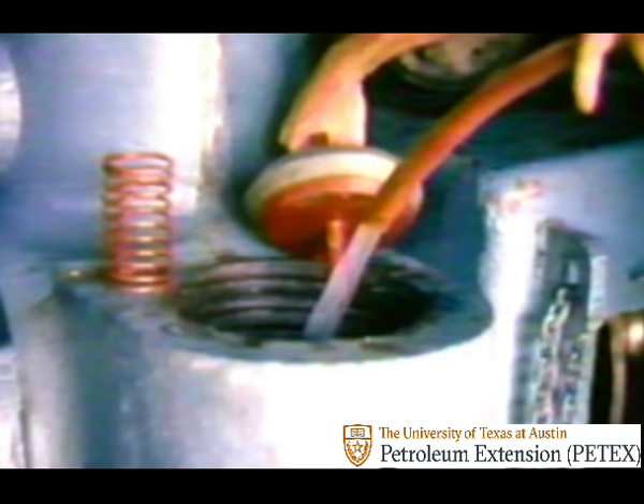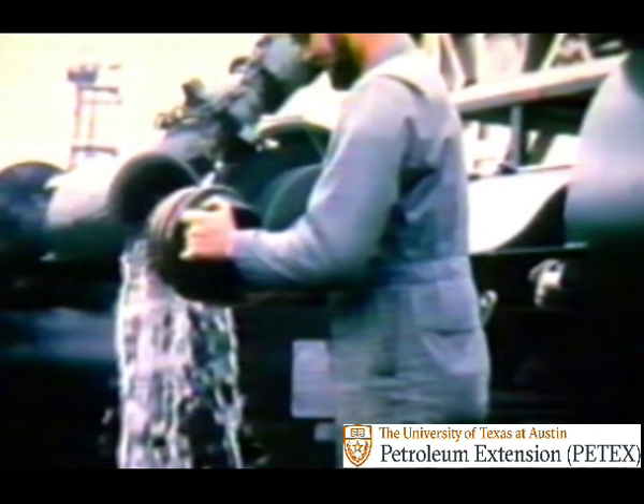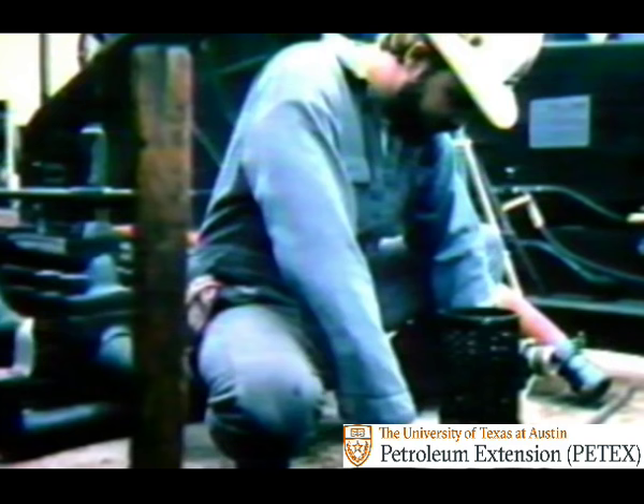So if your pump doesn't have a flooded suction, prime it by hand—preferably with mud. The shut-off valve between the tank and the pump must be closed, and the pump should be primed through all its valve pots before turning it on. If you do prime the pump with water to check it out, you should also do other maintenance at the same time, like taking a look at your discharge strainer. Unscrew the head, let it drain, and clean out bits of rubber and trash caught by the strainer.